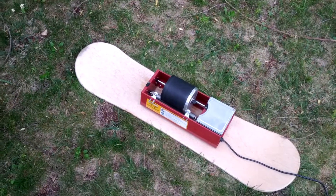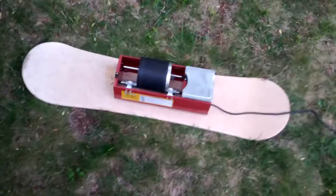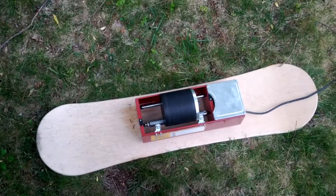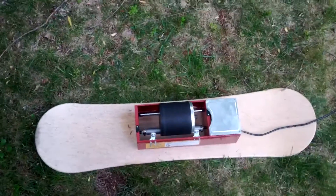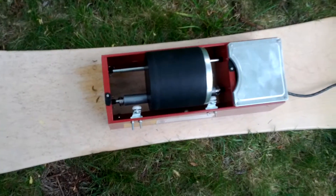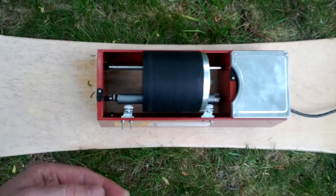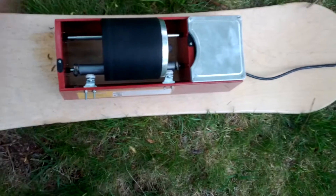I've done a couple of modifications. There's another video on YouTube called 'Souped Up Six Pound Ball Mill' and I took some tips from them for speeding it up. Right now I'm running at exactly 92-93 RPM, so it's perfect. The other video uses electrical tape — I did that first and had problems with the tape heating up, the glue allowing the tape to move around, and it jammed up my mill. So I used duct tape because the adhesive is a little better. I ran a bunch of strips around the roller, and when I got the diameter right from testing the speed, I ran a couple strips the other way overlapping to ensure it pushes down rather than pulls up the flaps.